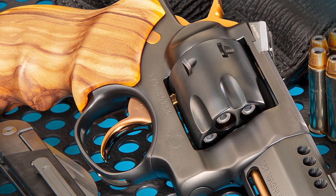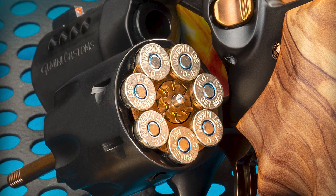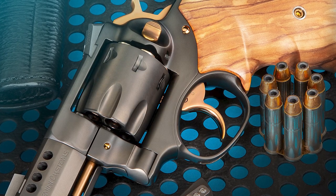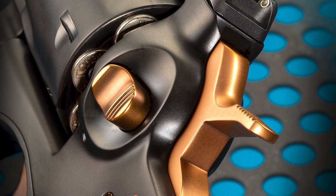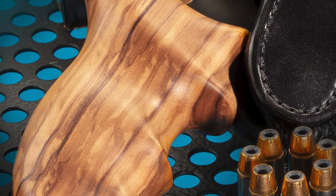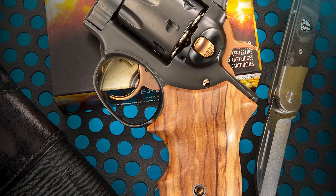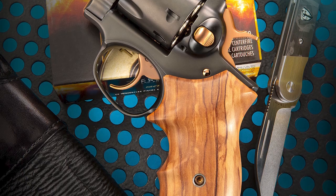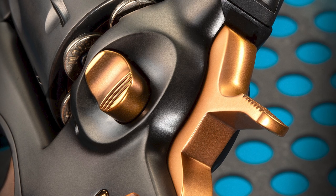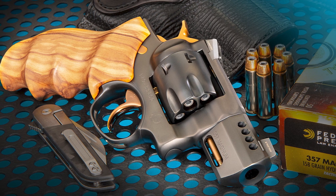The cylinder chambers are finished reamed, honed, and micro polished. The extractor is face relief cut, with radiused and polished charge holes and polished cylinder faces — it's just beautiful. Novak three-dot tritium night sights go in: double dot white rear and orange outlined front. He also has his Gemini Custom Gen 2 full-size world-class wild olive wood fitted embedded oil-rub finish grips — Mark makes these himself in his shop. The black and copper armor guard PVD DLC plated finish is by Richter Precision, with seven colors available.